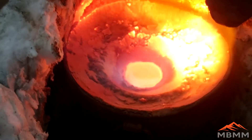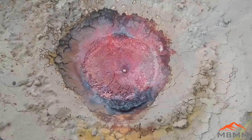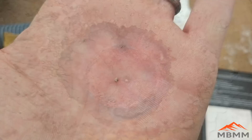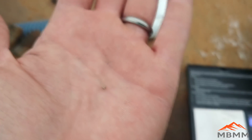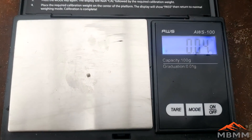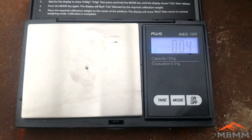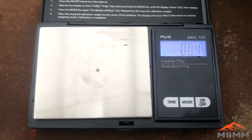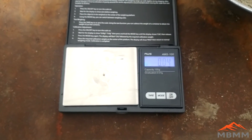Here's some shots of the cupeling process sped up about six times. As the lead melts it oxidizes, the oxidized lead runs in the cupel, and you're left with a precious metal bead containing all the gold and silver that was in the sample. Here's our first little tiny prill from cupeling our borax experiment. It weighs 0.04 grams. There's not much there, but we did recover some. As we get these other prills weighed, we can compare recovery from our different flux recipes.